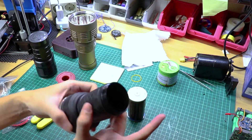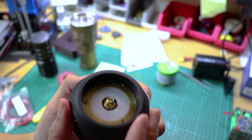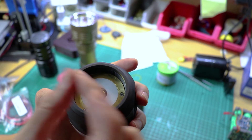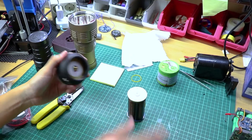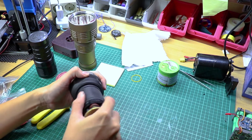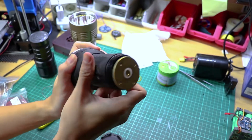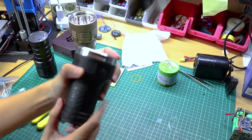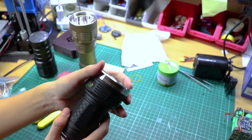The spring is bypassed on the driver side as well — the function of the cable is to bypass the length of the spring with a shorter path for the electricity. The increase is quite significant in my case, though it depends on the flashlight and the driver you are using. A spring bypass will benefit you most if you are using a direct drive driver.